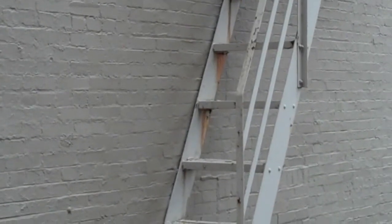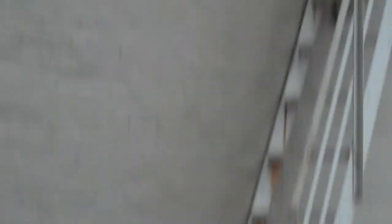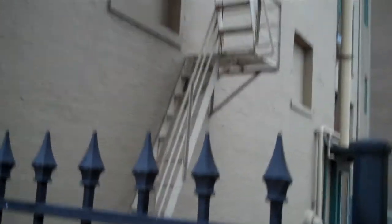Tears coming down the left side of a tread is an indication that the fire escape is structurally unsound, and any one of those treads can give way during an evacuation by one of the tenants or by a fireman trying to get up the fire escape to help somebody get out of the building or fight the fire. So it's an unsafe condition on this particular fire escape.